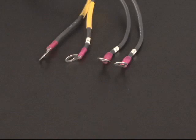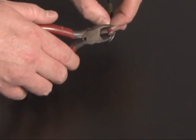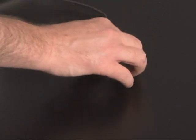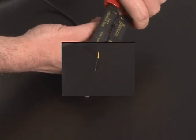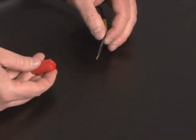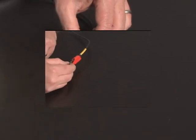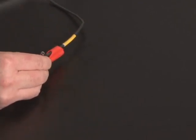There are four voltage connections on the reference standard: two potential and two auxiliary power. Each of these connections must be changed. Begin by removing the four ring terminals with the diagonal pliers. Using the wire stripping tool, remove approximately one quarter inch of the insulation on the positive potential lead, and slide the lead through the wire shroud of the connector plug assembly. Place the small set screw into the end of the connector plug and set it into place with one to two turns.